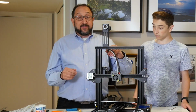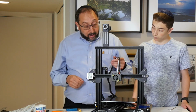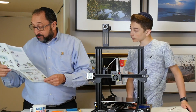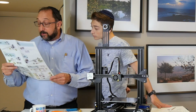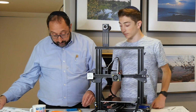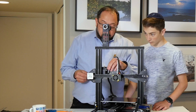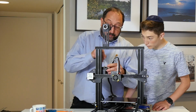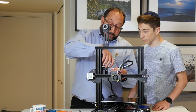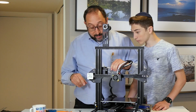However, I noticed that the Bowden tube is not connected yet. From past experience, I know where that connects. So we will connect that to the coupler here on the extruder. Let me just go back and see if there was a step for assembling the extruder that we missed. On the connectors. Yeah, so it is shown in step 12, but it's very, very hard to see. So let's go ahead and add a coupler. This can be really just slightly over finger tight. And then we're going to insert the Bowden tube by pressing down on the coupler. That releases the tension, and insert it there.